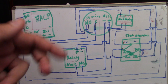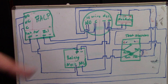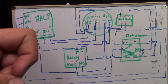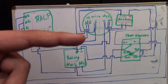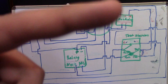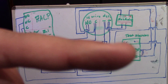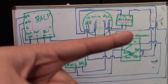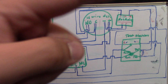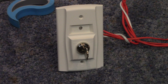The smoke detector resets when it loses power — that's how we reset it using simple relay circuitry. Finally, we have our zone power output. The positive and negative go out, and it doesn't matter which of the two terminals you hook up because the four-wire smoke detector just has a relay inside and relays don't have polarity. We jumper off those with two wires; one wire needs to be spliced into the relay so the leg to the resistor is cut when it loses power. The two leads continue down to our test switch on the key switch — completely separate from the LEDs, like a pull station. Then we have our end-of-line resistor that completes the zone circuit. There's basically nothing altered in the zone circuit besides the relay, and that is how you hook up the RTS151 key switch to a smoke detector.